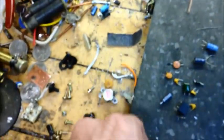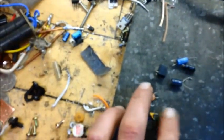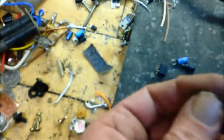But this is all the stuff we've yanked out of the radio. The old 3 kilohertz filter has been changed out to 6. All the cap changes that needed to be done to the values I do. Resistors. Took out the MPC mod. Very, very bad thing to do. I see this a lot. This seems to be a thing for the truck stops to do, where they put a rectifier diode in there. Really, it's a crap mod. Doesn't work real well. It gives you a lot of distortion if that's what you want. People think distortion's loudness, and that's not really the case.